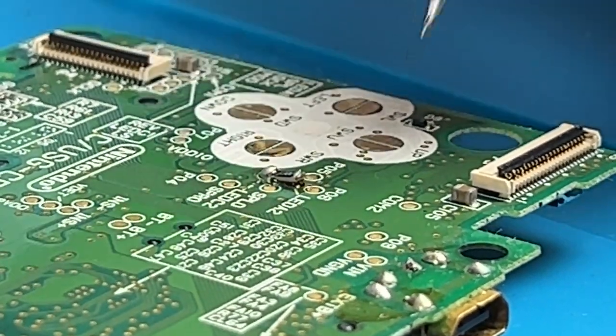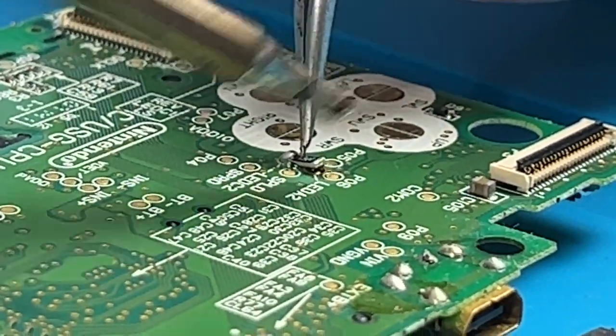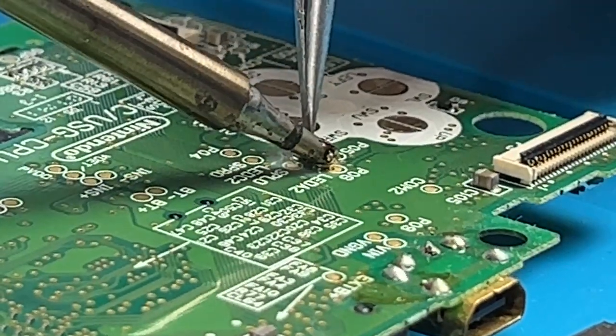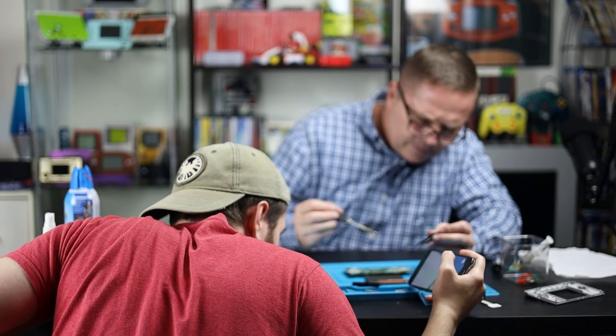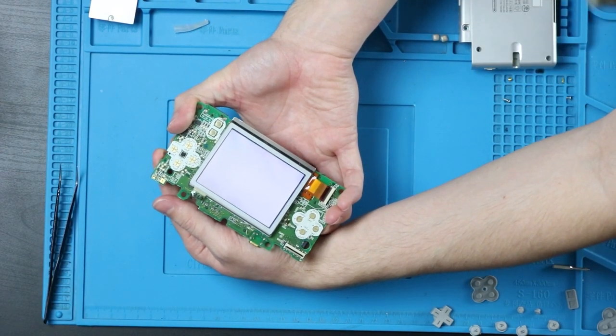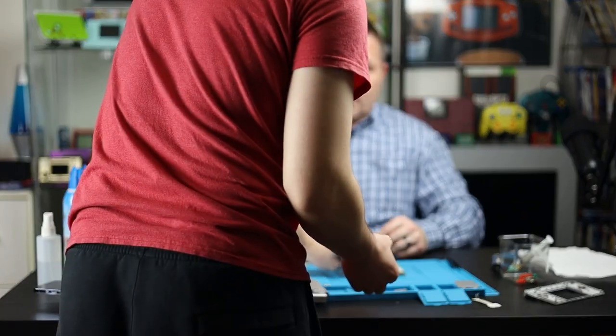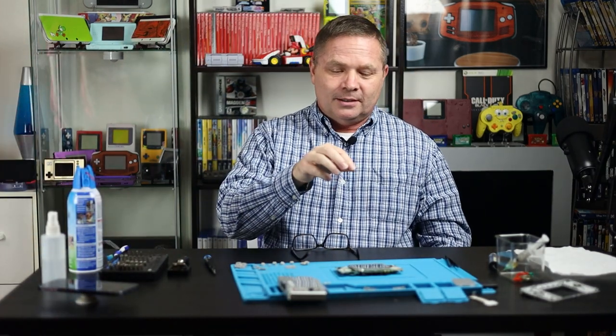Well, it's not releasing from the tweezer. That's not fair. Pinch the tweezers together and then push down on it. Now we're going to plug the soldering iron back in. I recommend using the tweezers in your left hand to hold it down so it doesn't lift off — because it will stick to the soldering iron. Oh, you're so close. Did I not get it? No, it's so close. I think you got it. And you were successful! I'm bringing this back — I told your mom. The dab? Yeah. The dab never left for me. I dab all the time. I just don't do it on camera. I just did a dab of solder.